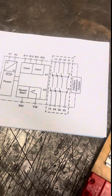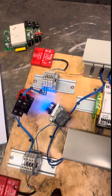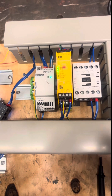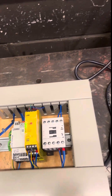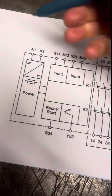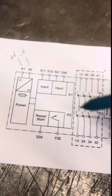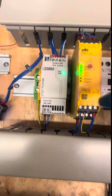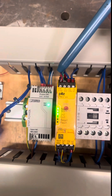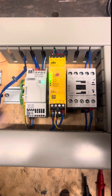I'm going to go from this schematic and show you real life on this. I know it looks a bit rough but I knocked it up and it's going to help me put my point across as best I can. This is fused down, so don't worry. On here we've got our A1 and A2 — that's your plus voltage and minus voltage, your control side. I've got this stepped down to a power supply so we've got 24 volts coming in, with A1 and A2 at the top and bottom.